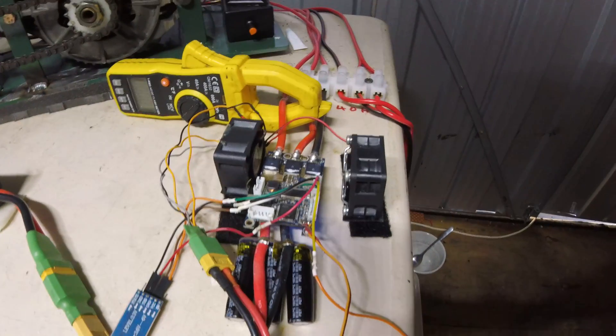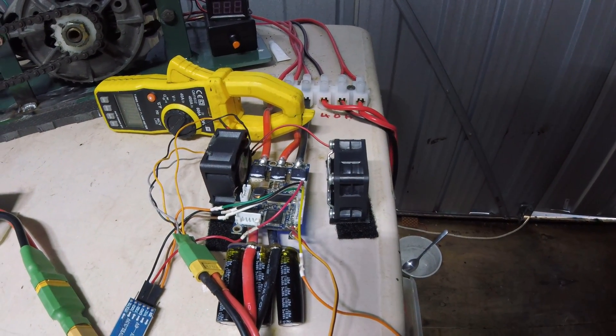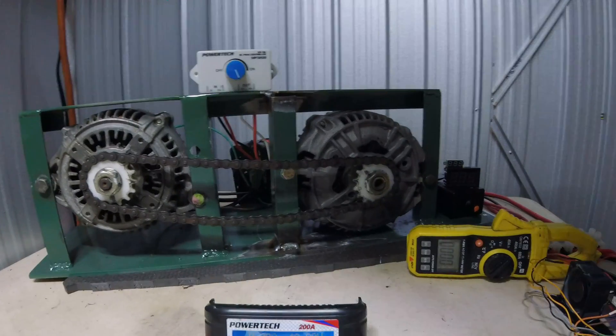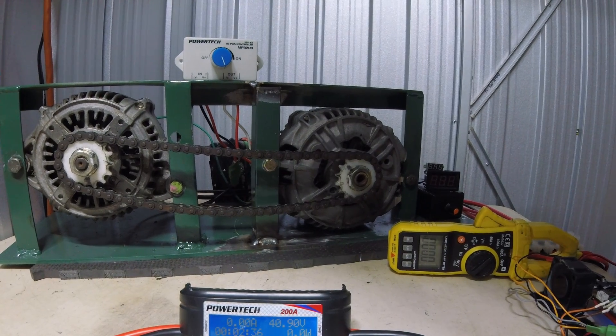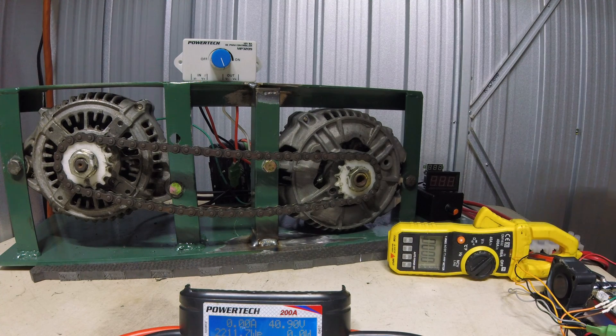So now I've just put two fans either side — one's sucking, one's blowing — so it's just running air over the ESC. With no cooling it just gets so hot and the heat can't go anywhere, so it stays on the board and you get a level that just keeps dropping and lowering. That's why the motors eventually stopped — it just got way too hot with no way to dissipate the heat. With the fans I think we should be able to expel some heat and find a better running level than without them.